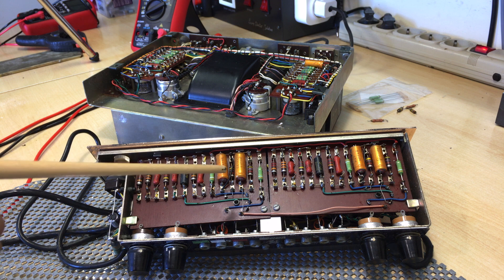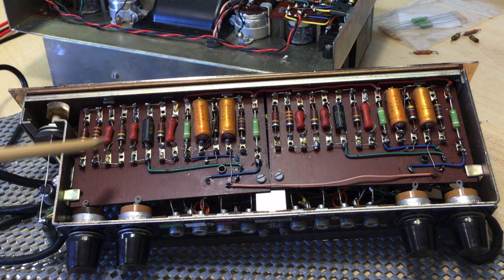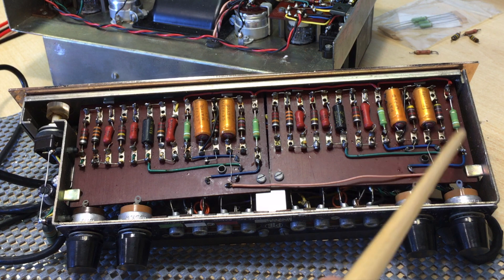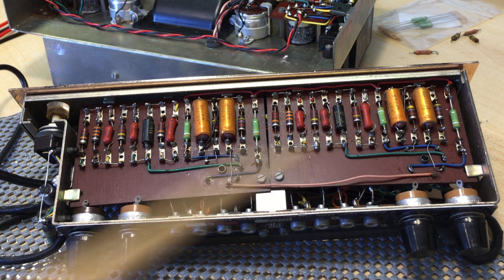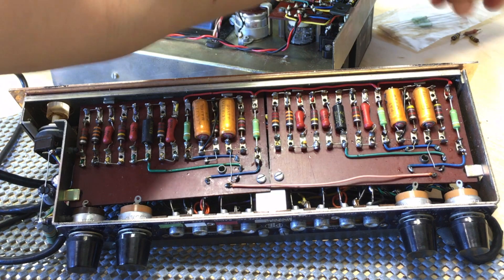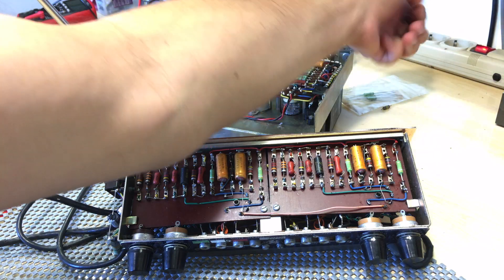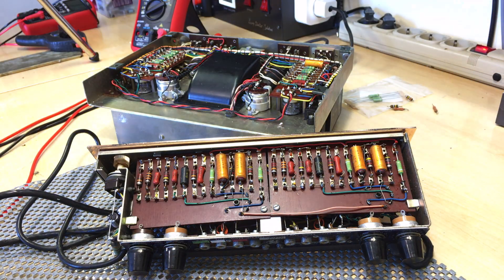That creates a bit of a problem, and I'll show you my measurements shortly. But first, when I opened up the preamp and did some checking, I found that all resistors were out of spec — badly. I've already replaced four of them: the anode or plate resistors of the two 12AX7s that are in here. They were completely out. It also looks like they'd been swapped out already — there were two types of resistors here, so I presume somebody did some changes previously.